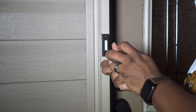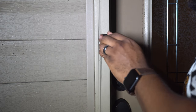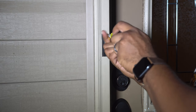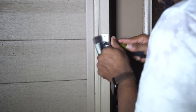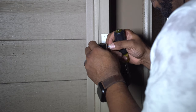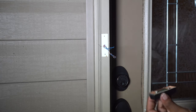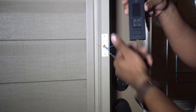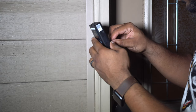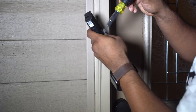The next thing you want to do is take your old doorbell off. It's very important — I should have said this before — but you have to make sure you turn your breaker off for your doorbell, because if you don't you'll get a shock. Take that off, remove the screws, and pull the wire out. These wires are very small and fragile; if they've been bent once, go ahead and strip out more wire, otherwise it'll break when you're trying to put it on the terminal point.